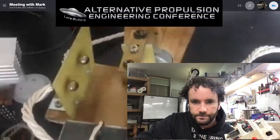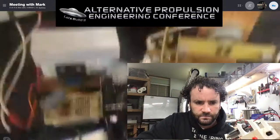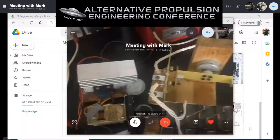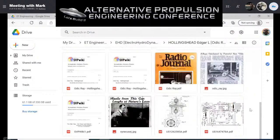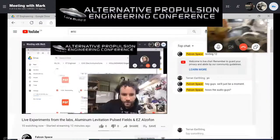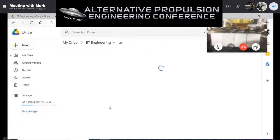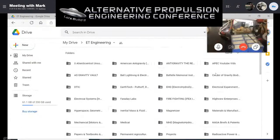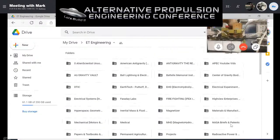So this is the mechanical rotary switch, and that's hooked up to the supply for now. And so we just have that hooked up to a coil of wire. This is about maybe 8 turns of it. It's a high current impulse from these low ESR snubbing capacitors, and we're running it off DC. So it's a 0 voltage switching circuit, modified CCFL transformer right there. So we'll go ahead and start up the noisy spark gap, and you won't be able to hear me all that well, but then I'll show you the foil and take a look.